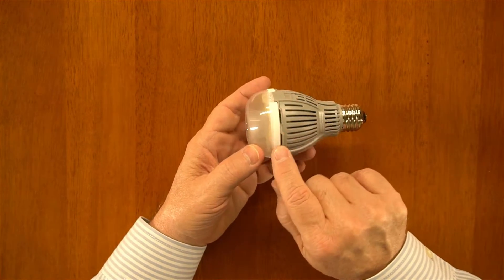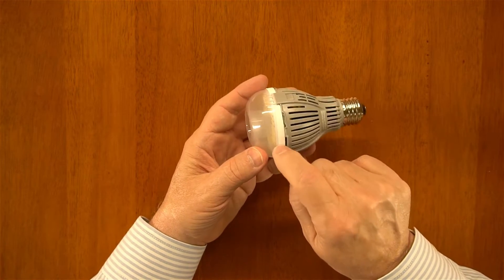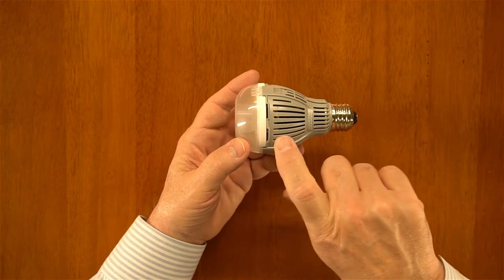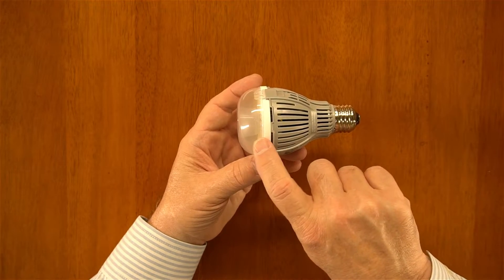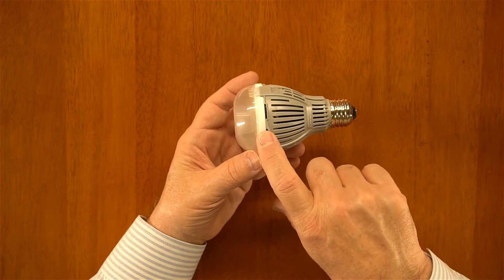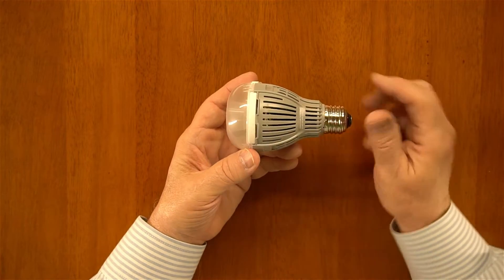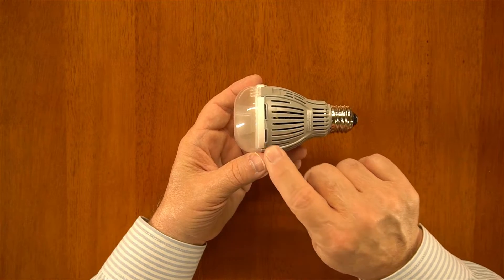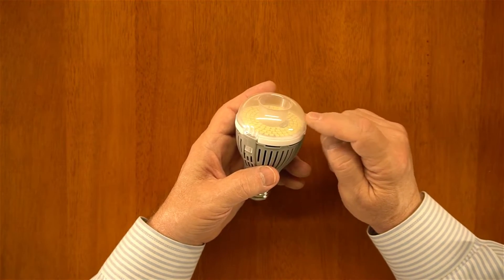On the top of the bulb, this white band right here is the base material that the LEDs are mounted on. That's ceramic, and that's important because a lot of companies will build that out of plastic — the LEDs themselves are going to get warm, so plastic is going to warp over time and may melt. Some companies use a metal layer with a substrate between them. Ceramic is the best you can do because it does a real good job of heat dissipation from the LEDs.